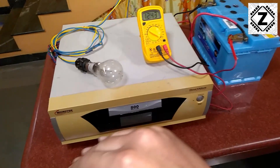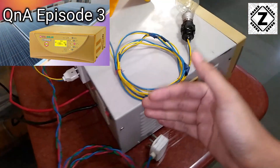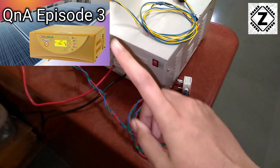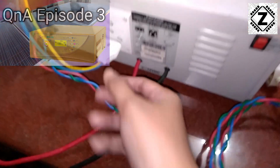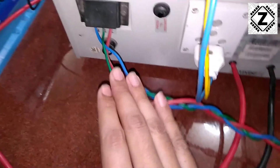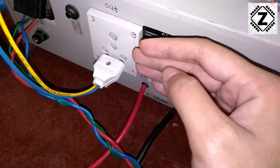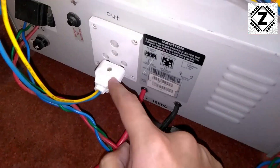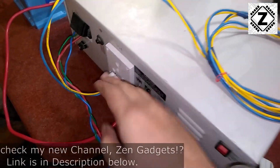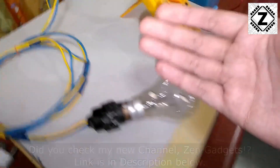Personally, I completely hate this kind of single wiring configuration. For your own safety and for the safety of your devices, I highly suggest you watch that Q&A we talked about earlier. Please provide proper neutral as well as earth to your load. In the input you have to provide the earthing from your earthing pit, and even in the output socket you should have 3 wires: phase, neutral, and earth. Please ask your wireman to connect all of these wires into the mains box of your home according to your house wiring distribution.